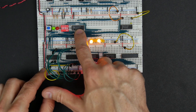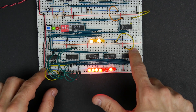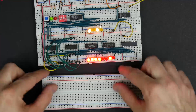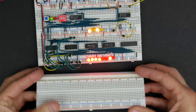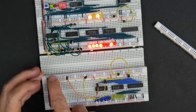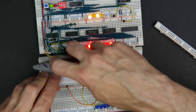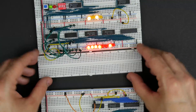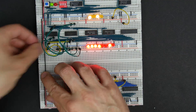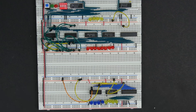We're going to use the 74LS157s to switch between the DIP switches and the bus for the data that we're storing in memory. To give ourselves a little more room, I'm going to use another breadboard here and connect it right below. I'm also going to connect the instruction register, which we built in a previous video, below this — it's a good place for it when we put the final computer together.